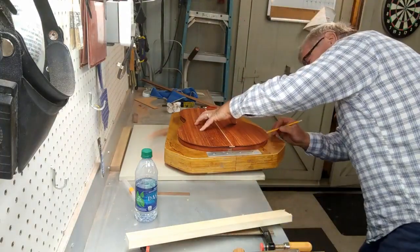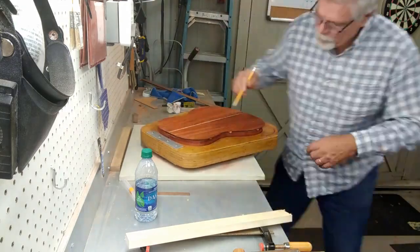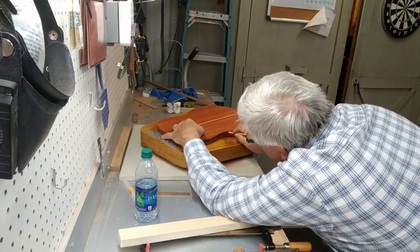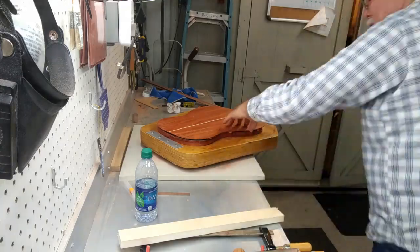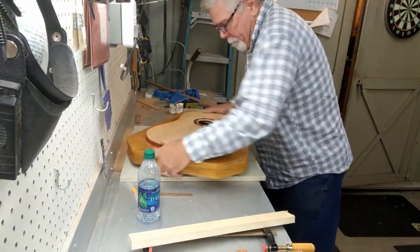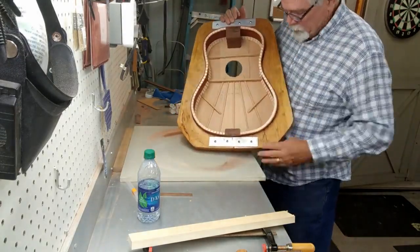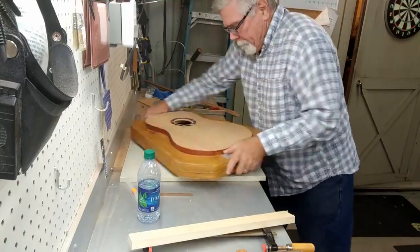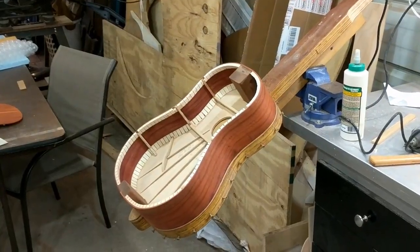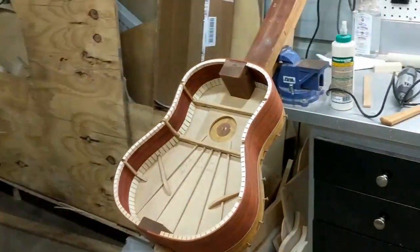And now we're back to the same process as what we did before, where we're aligning the back and making sure that the bracing where it intersects is cut, and all of the kerf liner is out of the way so that it comes together. And again, I flip it over and I'm using that sandpaper again and working that back well. Well, it's ready to assemble now.